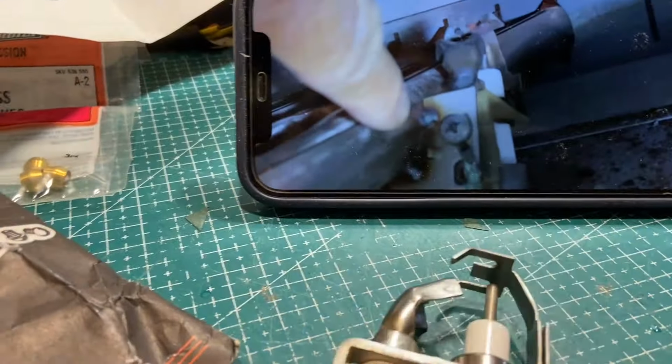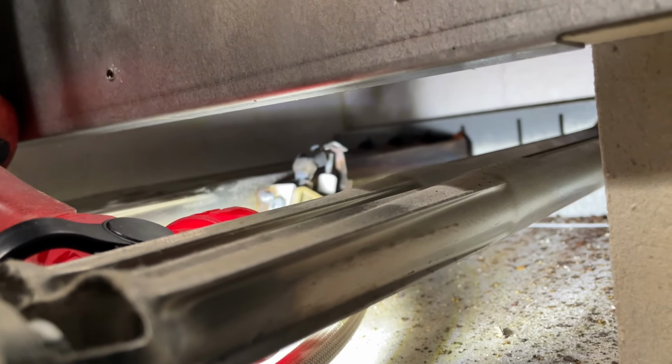So in order to take out the burner tube, you can lift it at the front where the gas manifold is, and then just pull it straight out. So the flame sensor igniter sits on a bracket that is attached to burner tube number 4 from the left. So to reinstall the burner tube, you just put the tab in the back in place and then just press down the tube on the gas manifold. So that's the way the flame sensor assembly sits in my boiler.